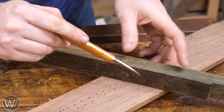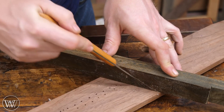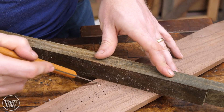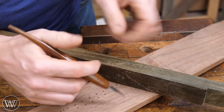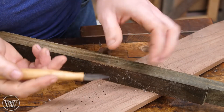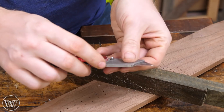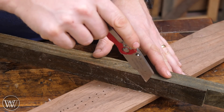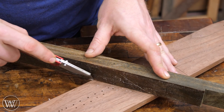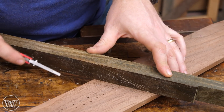If I'm doing that with a shorter knife, number one, it's too short, so I'm going at an angle and there's a chance I'll either ride up the board or push the board away because I'm trying to dig underneath it. Putting it at a weird angle is just a pain for anything shorter than the preferred knife — it doesn't have that shank to sit in there. Something with the same double bevel design but a shorter blade means I can't quite get in there. That's where a utility blade or something similar also has problems. I'm not going straight down on the board; I'm coming at an angle, which makes it tuck underneath and I'm not getting the angle I like. There's also the problem of it riding up the board.